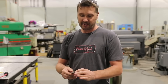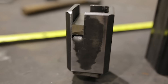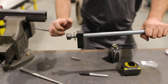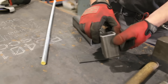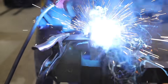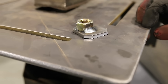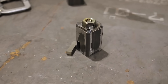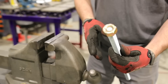The high speed steel should have a square back end that rides against the inside wall opposite the weld seam. The cutting edge can also be square or neutral — if you're not familiar with how high speed steel works, you don't have to worry about sharpening it. To drag the slug through the tubing, we use a piece of all thread — use the biggest piece you can and get it as close to the cutting edge as possible. We're going to make a cap for the back: drill a hole, weld a nut, and get that hole as close to the cutting edge as possible to prevent the slug binding as it walks through the tubing. Be careful not to over-weld the nut because you'll distort it — just some good tacks to keep it from twisting off. The weld seams on these tubes are never the same, so over the years you might end up making a couple of different ones. Cut the rod to length and weld a nut on the end so you have a way to grip the all thread and twist it.